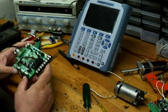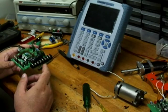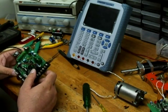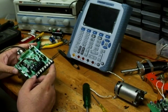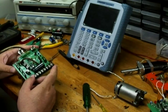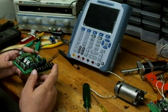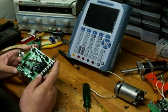12 volts input to 48 volts input, also 12 volt output to 48 volts output. It'll do 100% PWM, so if you put in 12 volts you'll get out 12 volts — likewise for 36 or 48 volts. The frequency of this unit is adjustable between 150 Hz and approximately 1.5 kHz.